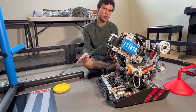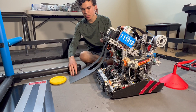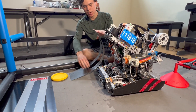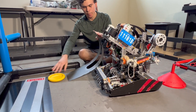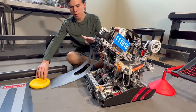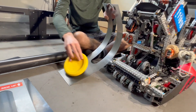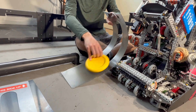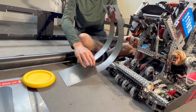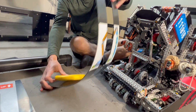After that, it's just all about the improvements, which I'll briefly go over. The first thing we noticed was a black line in the middle of the snail after we fed a couple of discs, which is why we introduced this cutout. The black line indicates that this edge of the disc was significantly rubbing against the snail, so we just made this cutout.